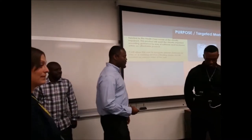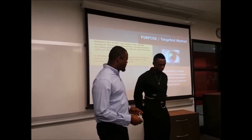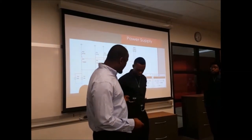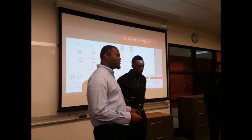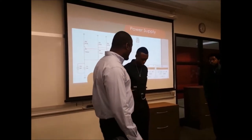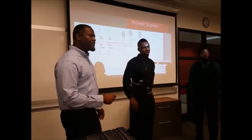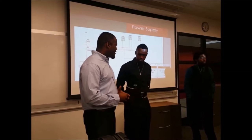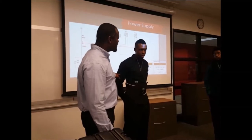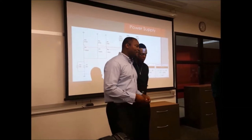Like he said, it's a belt to help the blind navigate around objects. This is the prototype that we have right now. Originally we wanted to use six sensors so we could pick up low objects. With this prototype, it'll probably pick up objects from about 4 feet and up. When the object gets within about arm length, which is what we measured, it'll pick up the object and he'll maneuver around it.